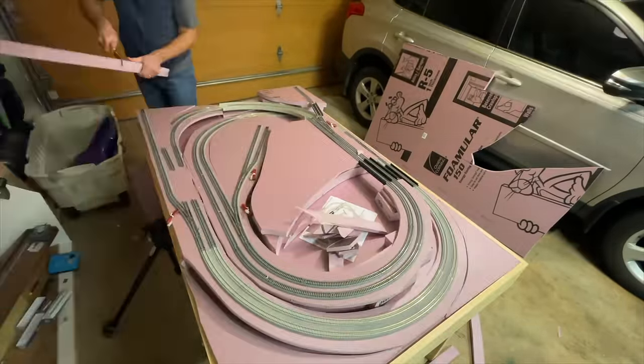The crossovers, though, are insulated already, and so while they are DCC friendly, you do need to apply power to each leg of the crossover as power will not flow from one side to the other. You don't have to have the power leads directly attached to the ends of the crossover, of course, but making sure you have power connected to tracks on each side somewhere is important. I tried to make sure there was power connected to each track in between each set of turnouts, as well as in a couple of extra locations for redundancy.